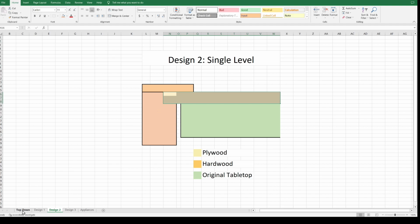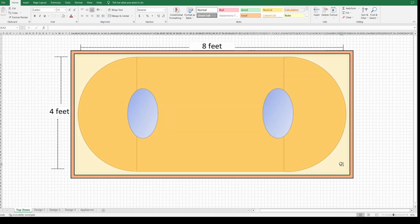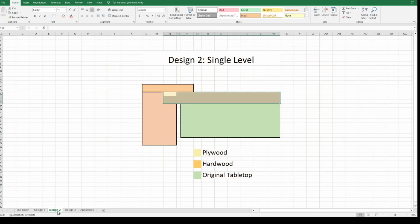Okay. 3/4 inch plywood. I decided not to mess around when I was looking at this part of it. I say this is just hanging in space, and so I did not want to have only a 1/2 inch plywood. I went for 3/4, and I also found that once you attach the side rails, it firms this up, so it's just about as solid as the table itself. Okay, so that's all well and good.